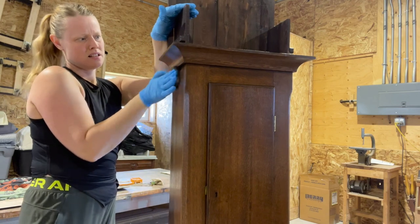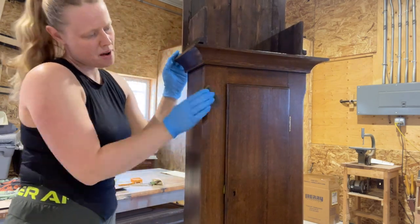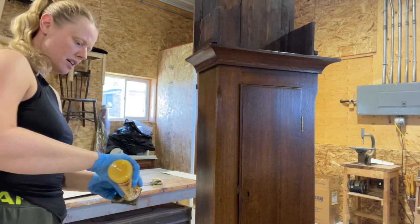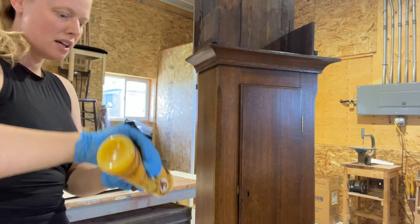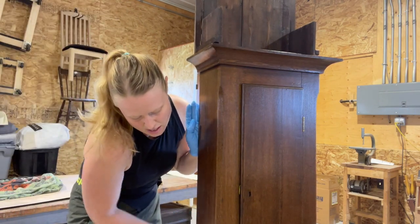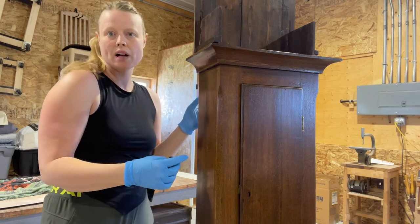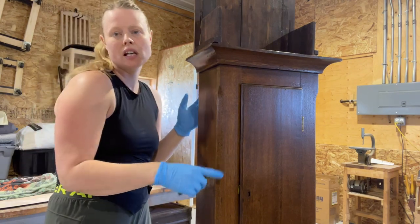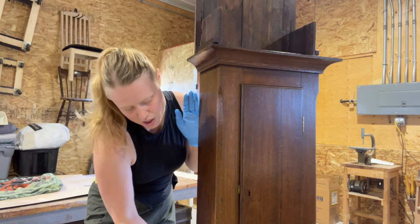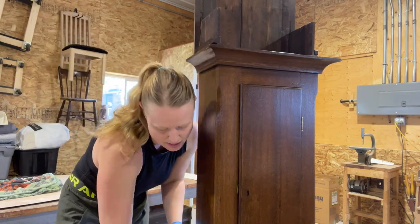And this polish will also protect the finish. Not much, just mostly wax. The only thing that wax really protects against, with stuff like this polish or other beeswax products, is abrasion. So if something hits the clock, if it's a waxed surface, it more easily slides off, rather than if it was not a waxed surface and is a little bit more grippy, you would run into it and kind of dig into the wood. So it's just protecting that surface. It does not really protect against water, moisture. Waxes and polishes make the wood look better, but it doesn't protect against any of that.